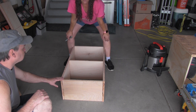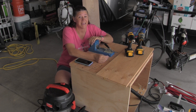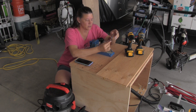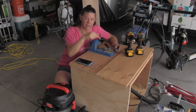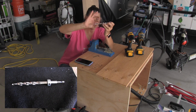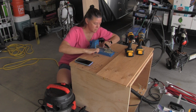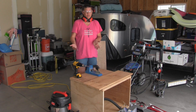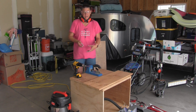We're going to use the Kreg jig — this is my favorite tool. My husband teases me that I love my Kreg jig more than I love him; he might be right! Setting up the Kreg jig isn't that hard; you just have to get used to it. It's designed so you can work with different thicknesses of wood and the hole will still be at the right angle. Right now I'm setting up the drill bit — it's different from a regular drill bit; it has a little step and markings so you can set it to the depth you need. I'm going to do a test run with a scrap piece of wood first, and I have my vacuum set up to catch most of the sawdust.